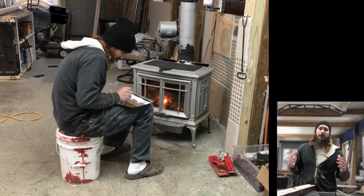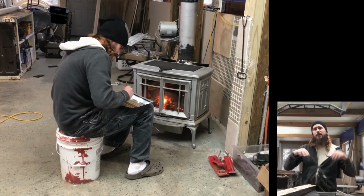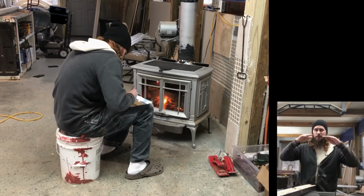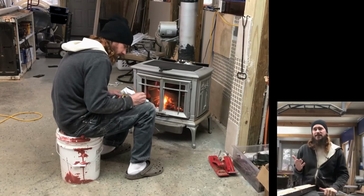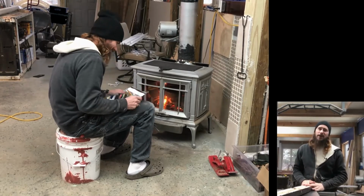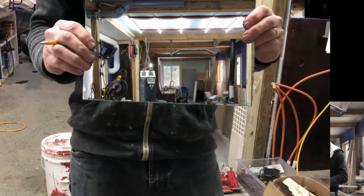I think that first plan would have worked, except my ceiling is sagging. I built those bays with a top and a bottom and I shoved the insulation in there, but it was a little thicker than those bays and it's pushing down on that sheetrock, causing pretty severe droops that I didn't see until I was putting these lights up. So this is the process I'm going to go with now. Like I said, if you want to go with that last process, it works, but check this out.